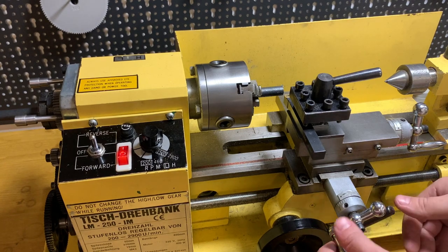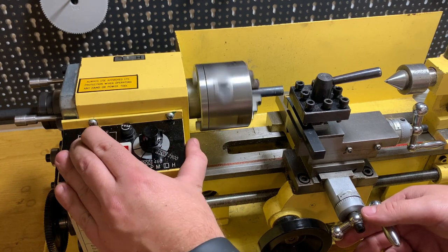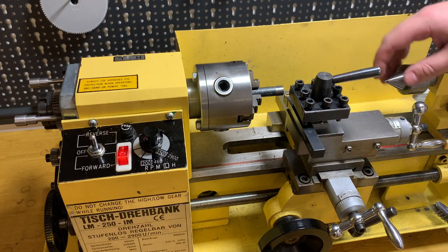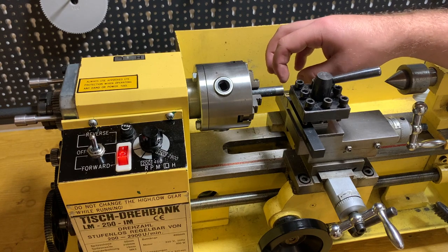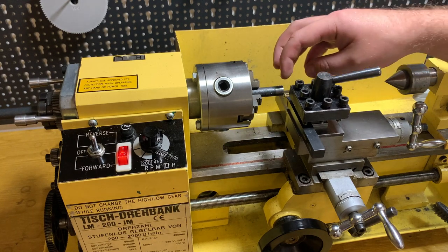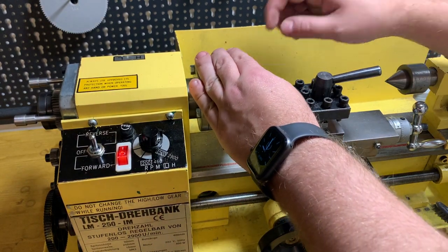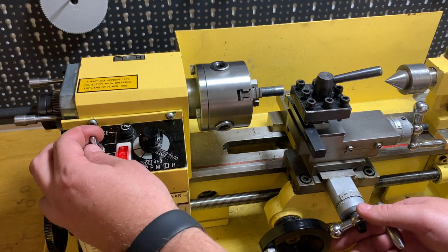On the handle I will start with the thread. So it's an 8mm thread, so let's go. I will cut 10mm of thread because here I have the hole for the center, so I need to go after this hole, and then I will cut this part with the centering afterwards, after all work on the handle is finished. Or maybe even more than 10mm. Yeah, I think I will go like 15mm at least. Anyway, let's go.